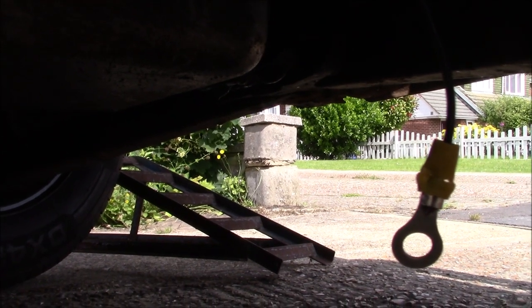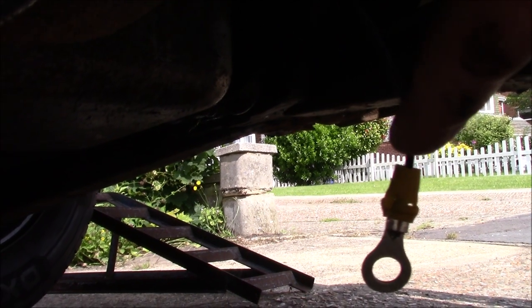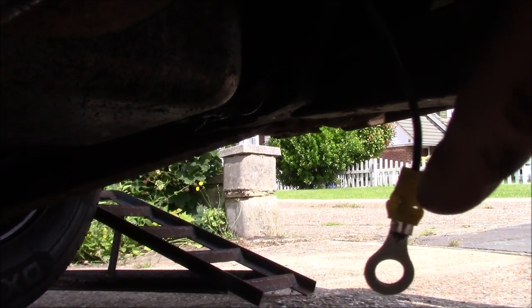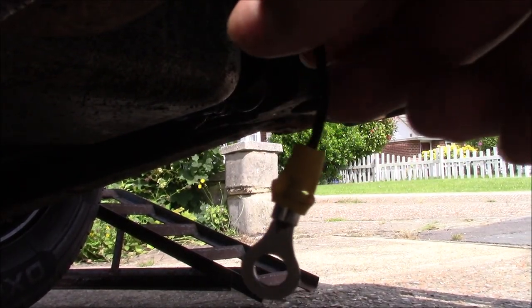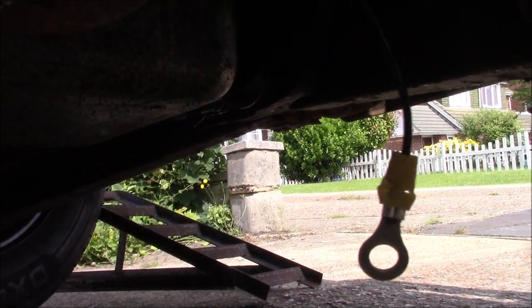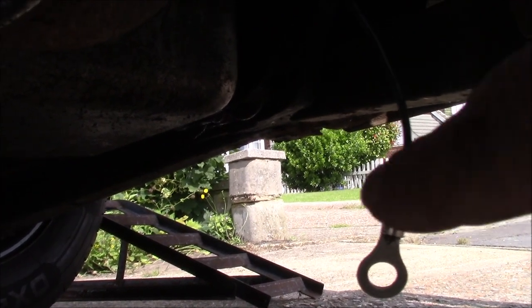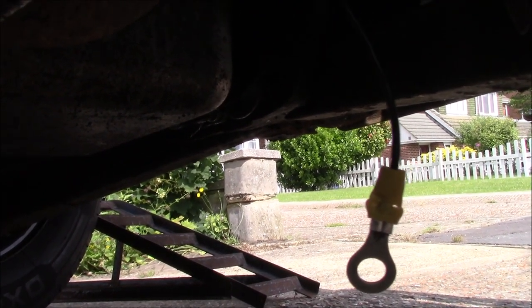Next job - let's get that eyelet put on. Well that could have certainly gone better. It's not the cleanest job but I stripped this wire back to good clean copper, got rid of all the brittle bits off the end that had broken out the old crimp, and crimped the new end on. It is nice and secure. The only problem I was having was the yellow plastic bit - it wouldn't move out the way when I was trying to crimp it, and then that meant you had to crimp the plastic, which just squashed out the way and tried to push the metal connector off the end of the wire. A bit of a faff but we are there on that one.